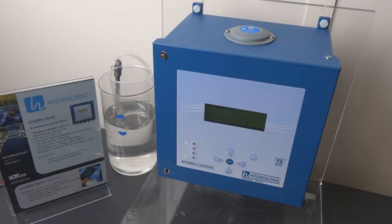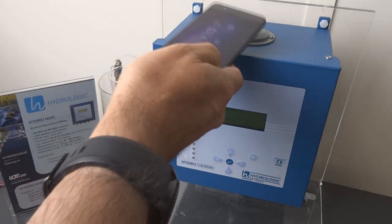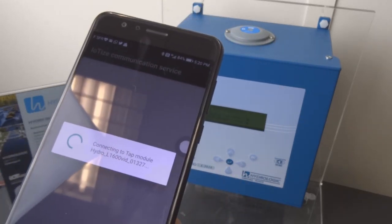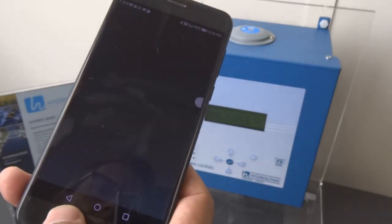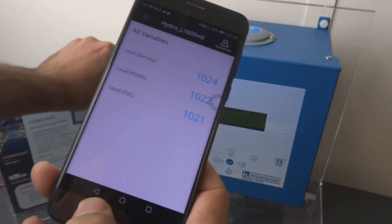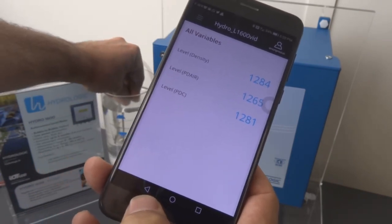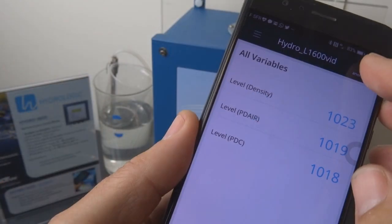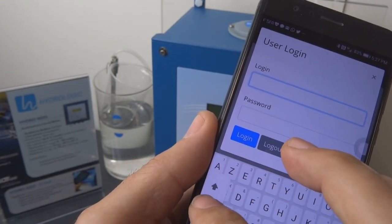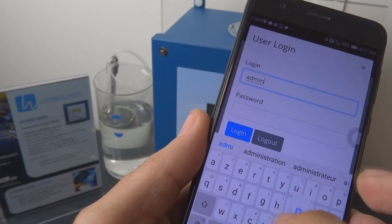Here is a smartphone connecting to our tap-and-link on the target product. The smartphone's NFC interface wakes up the tap-and-link module and pairs the Bluetooth Low Energy interface with that of the smartphone. Based on the tap-and-link's configuration, the smartphone automatically launches our user interface app, which is identical to what we created and verified in IOTIZE Studio.